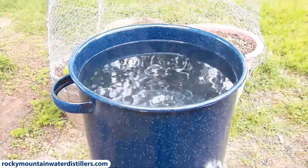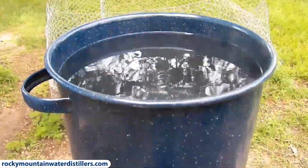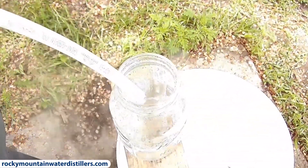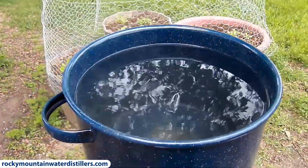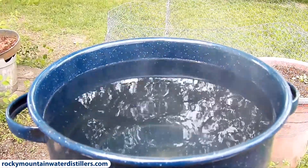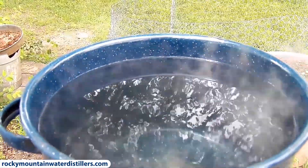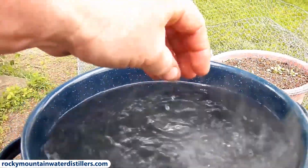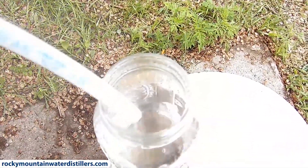Let's see if you can see the evaporative cooling in action. A lot of people think you need to have cold water in the top pot, but you actually don't — we're still producing water right now. We had to switch cups while waiting for the other to cool so we can show you the TDS levels. This is how the system works: evaporative cooling. The pot on top continues to evaporate, and through evaporation it cools the top pot. So this pot is probably running around 140 to 150 degrees and we're still producing water.